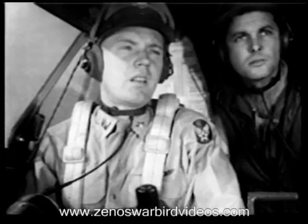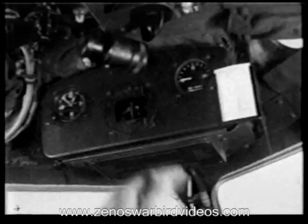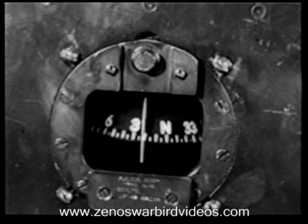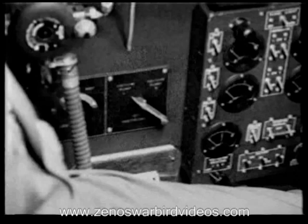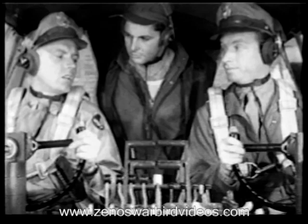Now for the rest of the instruments. Check the ceiling panel and make sure the compass card is able to move freely. Hydraulic pressure? Still about 800. Suction gauge? 4. Okay. Try it on the other vacuum pump. Same reading. Check. Turn the switchback to use the left vacuum pump on number 2 engine.